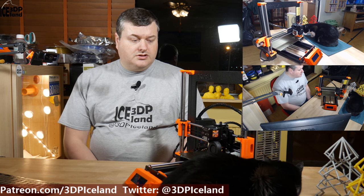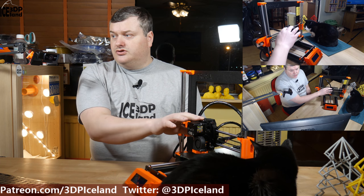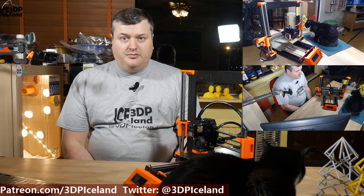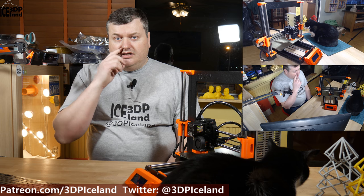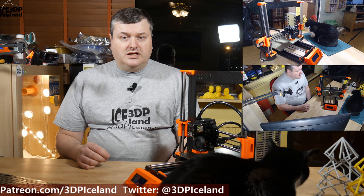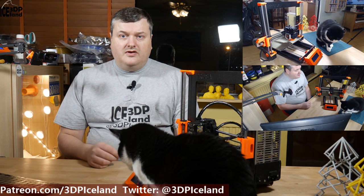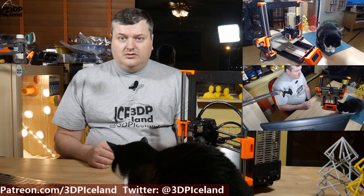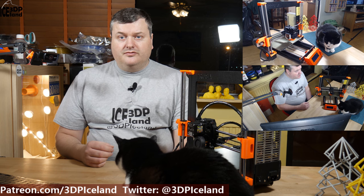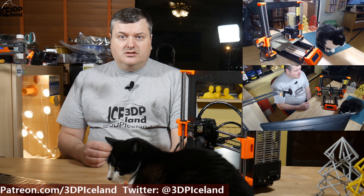Also two features in the extruder assembly. One is the Bondtech extruder. It's a very solid design and will grip both sides of the filament, and it will make sure that the filament is going smoothly to the hot end, and has very good control of the filament. And also on the hot end assembly, or extruder assembly, is the Pinda Probe version 2 that has a thermistor built in, so it's not sensitive to heat.